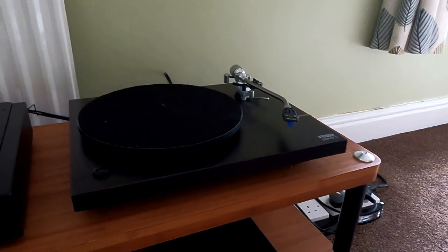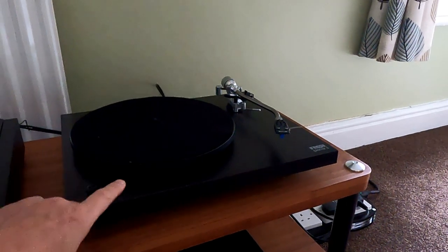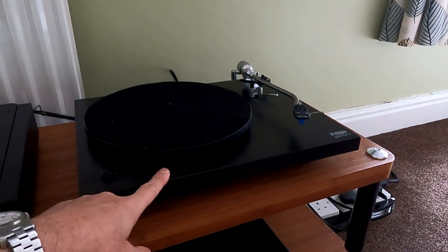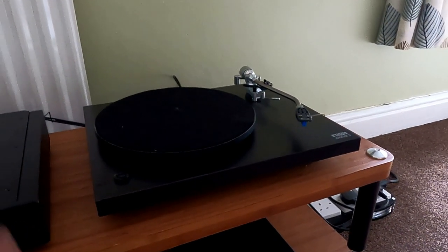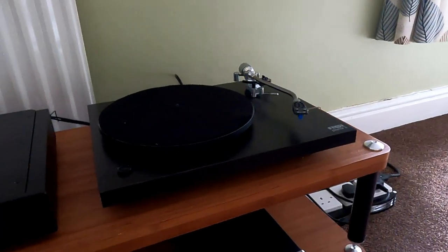So that's the earthing sort of noise, which, like I say, you will get with it. Most turntables have a separate earth. Later Regas don't have this. Like I say, this is an early one, so it does have a separate earth. Later decks, whatever you hear on forums, or whatever advice you see on there for the later Regas, it's wrong. You don't need to add another earth, because they are earthed, and there's never any problems with earth.